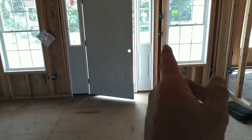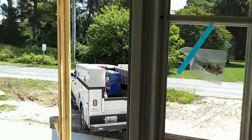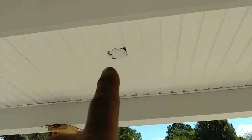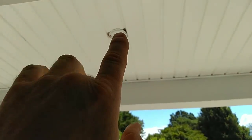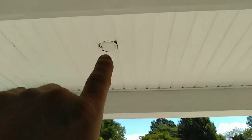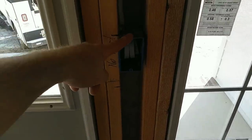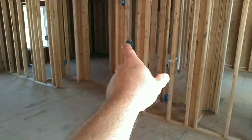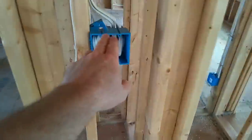I rolled with what I had. The top switch is going to be your outside light — that was cut by the vinyl siding guy, which is kind of sloppy and may have to be redone. This switch here is a three-way switch, switched from this location to that location right there. The other switch at this location is going to be for the fan on that light.